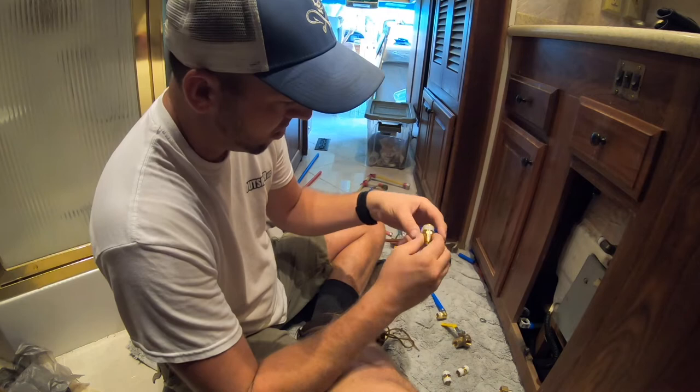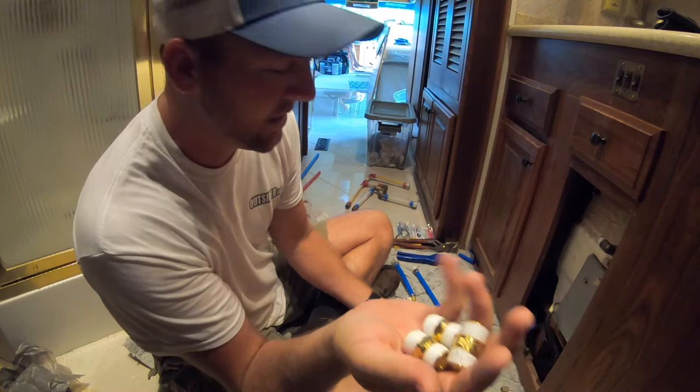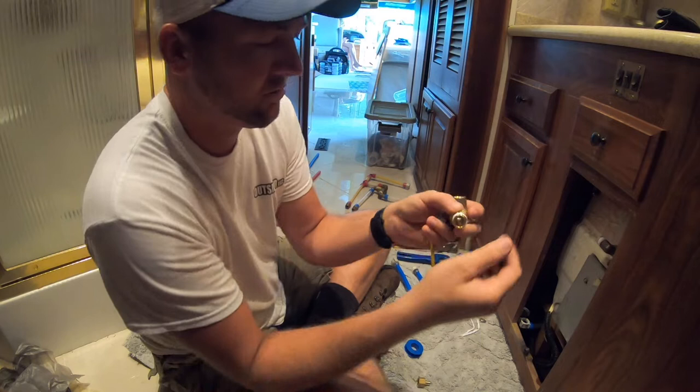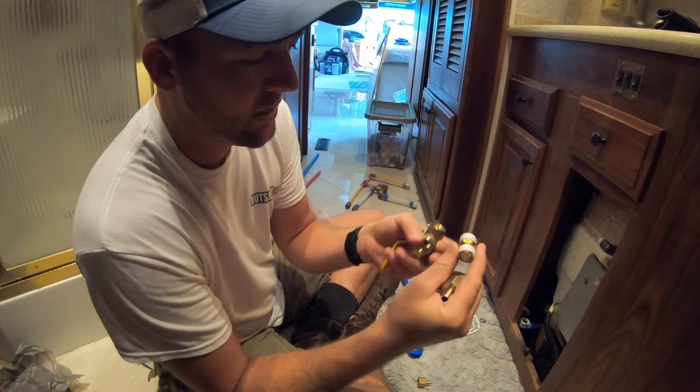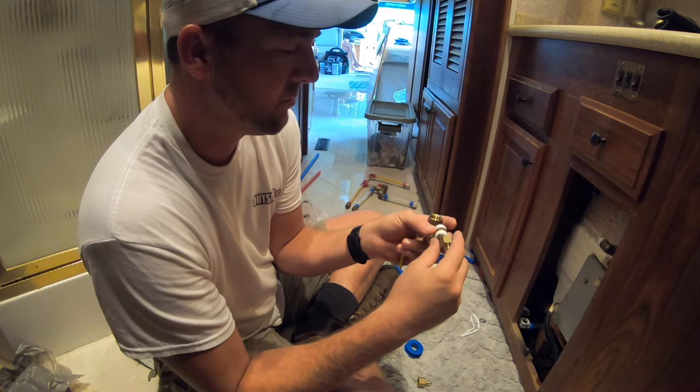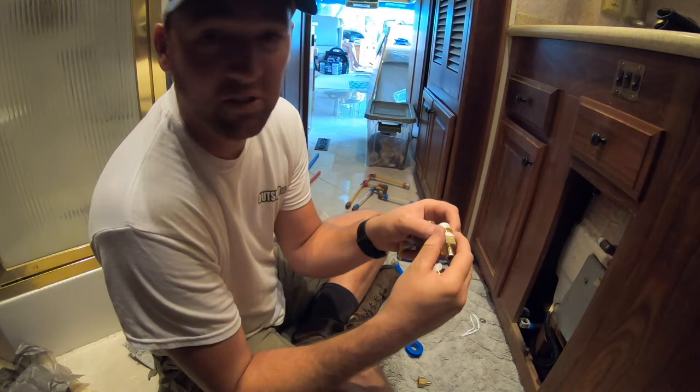Okay, I've got my fittings all wrapped in Teflon tape for a good seal. Let's go ahead and screw these into the ball valve, and then we'll screw on the PEX pipe adapters. For those of you wondering, this is a half inch ball valve. It's a three-way ball valve, half inch NPT unions, and then half inch NPT to half inch PEX. I'll put all this information in the description, but the same thing will apply if you have a 3/4 inch valve or a 1/4 inch valve or whatever, different sizes and shapes. All these same things will apply in general for your plumbing needs.